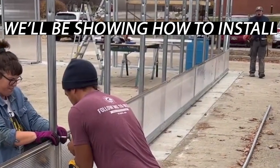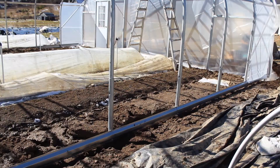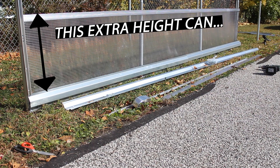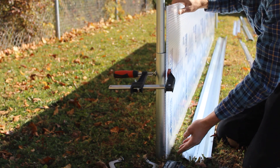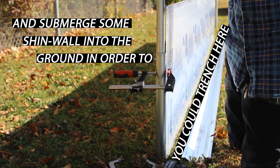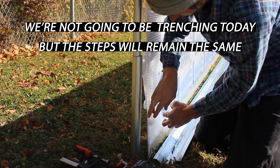If you like the way this looks, we do manufacture and sell greenhouses, and I'll link to where you can get a quote in the description below. Baseboards on their own don't usually come off the ground more than 4 to 10 inches, but adding shin walls to a structure can create additional height, which can provide additional insulation, protect the youngest of plants when the roll-up sides are up, and if you're ambitious, you could even trench out the full length of the structure and submerge some of the shin wall into the ground to keep out pests. For this video, we're not trenching anything out, but all the steps shown would still remain the same, so let's get into the tutorial.